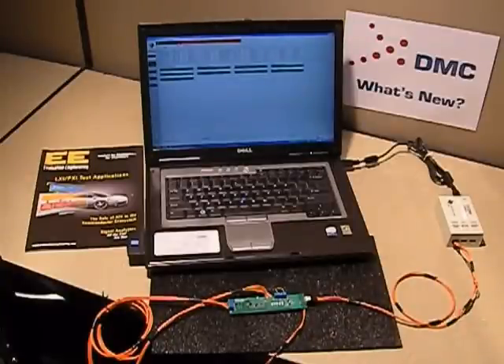What you'll see here is a demonstration board from Texas Instruments that you can buy readily from any online vendor. In this case it is the BQ20Z90 evaluation module from Texas Instruments. This board demonstrates a BMS system that primarily consists of a single chip — the Texas Instruments BQ20Z90 — and supporting electronics on a single PCB. This BMS is primarily used in laptop battery supplies and is designed to monitor four cells of different chemistries.